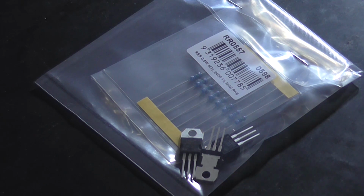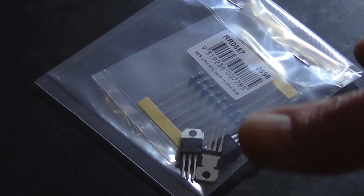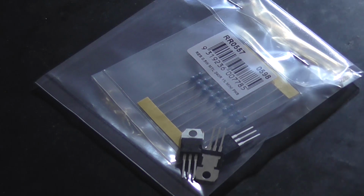There's no point. It's the same as the positive side 15 volt regulator. It's just a different resistor value. I set it to get 12 volts at 2K2, I believe it was. Anyhow, I can always use the built 15 volt side to test that output voltage with a different resistor. So I don't really need to put the third regulator on there, but I can if I want.